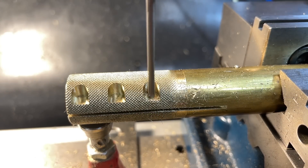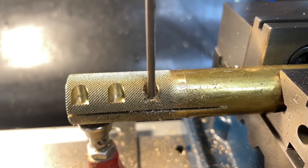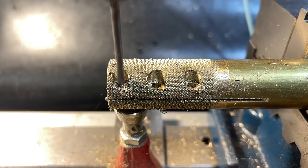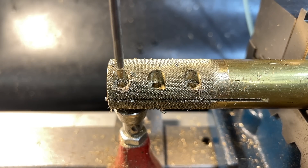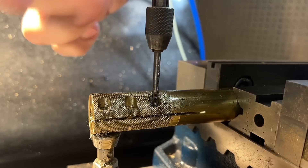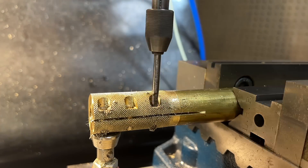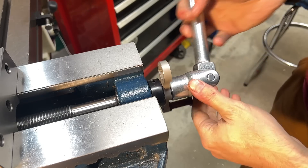It's now time to drill all of these straight through for an 8-32 tap. The top sections will then just be drilled for clearance around the screw. Once that's finished I'll tap them for the 8-32 thread using a hand tap — it's brass, it's a small thread, and it's easy enough to hand tap. And that's all the work that needs to be done on the milling machine.